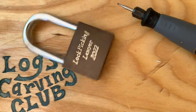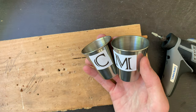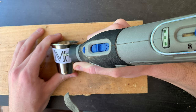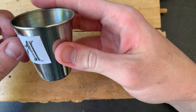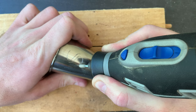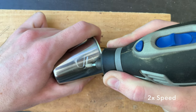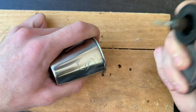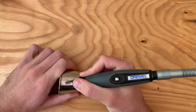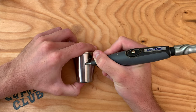Hopefully the Lockpicking Lawyer likes this. You may have seen in a previous video that I started these stainless steel shot glass engravings, but now I'll finish them. I started the same way by printing out a font and then gluing it, but I started engraving them with the Dremel 84922 and then the 83702 because I wanted that edge on the tip for making straight lines. I also tried the 83322, but none of them were as precise as I needed them to be for this application. Every one of the bits I've mentioned so far I've gotten in a pretty cheap kit from Amazon, which I'll link in the description. Usually I use these grinding stones on glass, but I'm using them on steel and they're dulling surprisingly fast against it. You'll find though if you're engraving wide letters on metal, it's better to use a thicker bit like one of these stones because it leaves less individual tool marks.